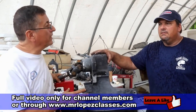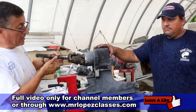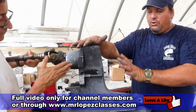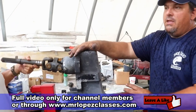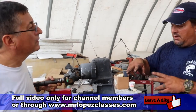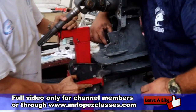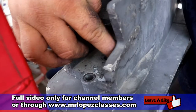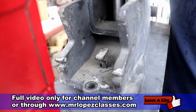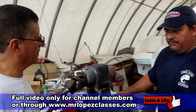In this particular case we are going to do the service on the raw water pump in an Alpha 1 stern drive. When you're pulling the drive out on an Alpha 1, you have to put it in forward gear. The reason is because in the transom assembly you have a fork — if it's in neutral it stays like this and you can never get it out. When it's in gear it's straight, so it slides right out. This only applies to Alpha 1 drives.